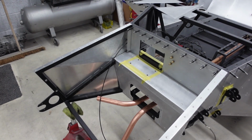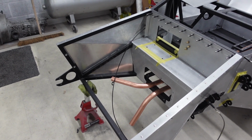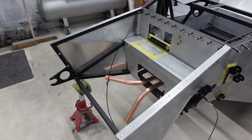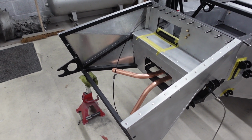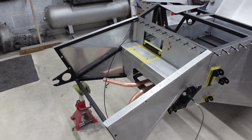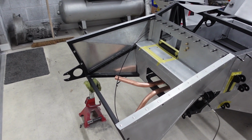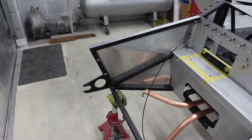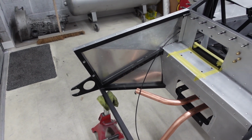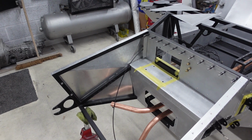I wanted to revise how the radiator was bolted in. Now previously it was just drilled and bolted through the chassis legs, those vertical chassis legs that you can see. Wanting to incorporate isolation pads between the chassis and the radiator, that kind of got me thinking that if I fit some M8 riv nuts into the chassis, that would then allow me to fit in my isolation pads